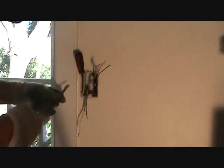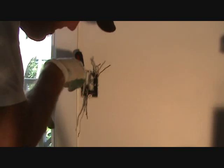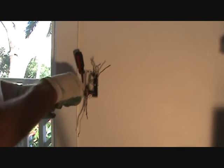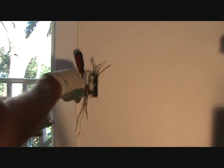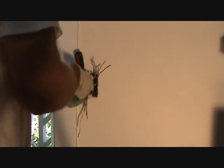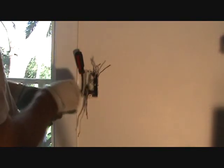Take that, swivel it up like that and get it out of the way. Make sure the blade is facing forward. Go down in there. It's nice to do it this way instead of a Sawzall — just in case you hit a wire or cut through the wall. You can feel a lot with this. Make sure there's nothing in your way. Now I'm just going to go ahead and cut this one off. You've got to hold it kind of close to the wall or else it's going to bend and you're not going to get a good bite.